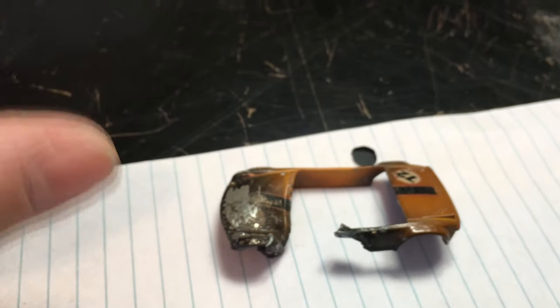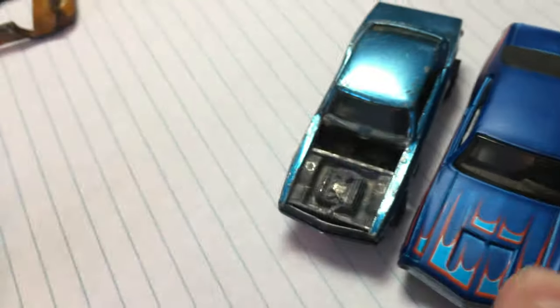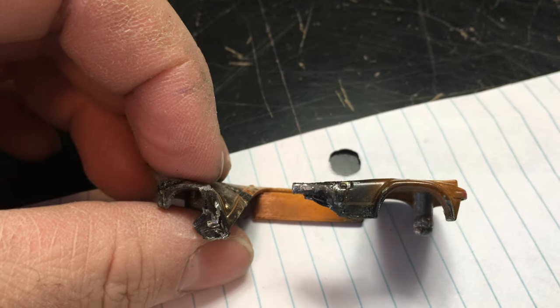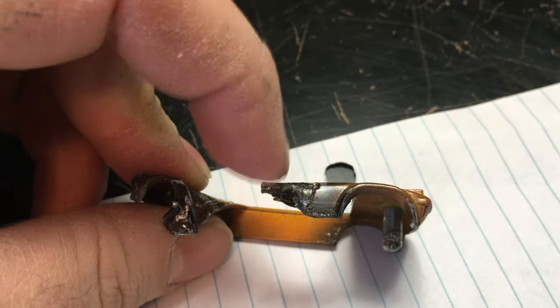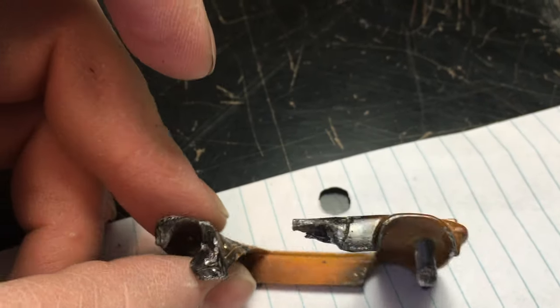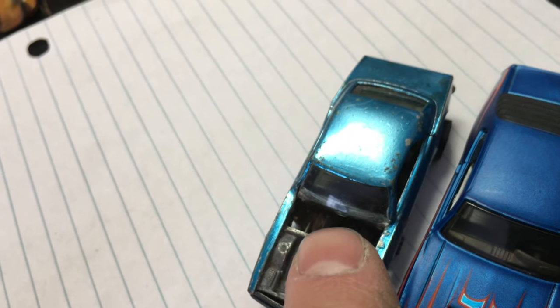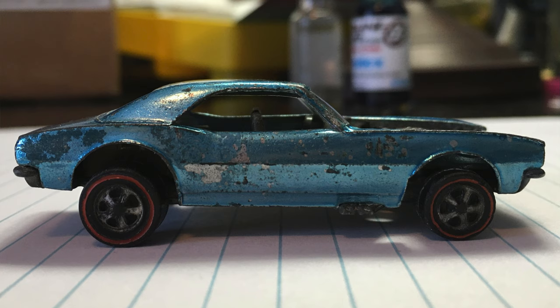I did try something earlier in the shop — you can see that car is shot. I thought I could maybe solder on this casting here, but after doing this it's not worth it. You've got to get this metal so hot that it will either bubble before the solder adheres, or when it's at the bubbling point it's also ready to just fall apart and melt. All I did was touch this with a screwdriver and it just folded over. So solder is not going to work — we're going to have to resort to getting a really close fit and gluing it in place.